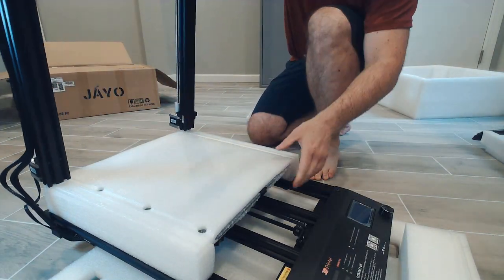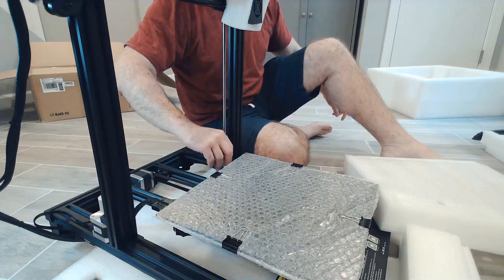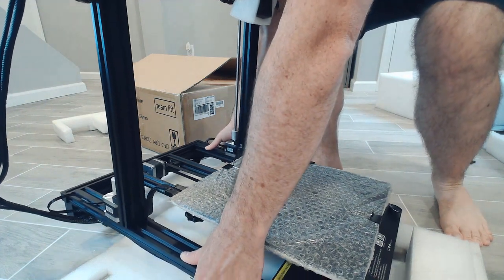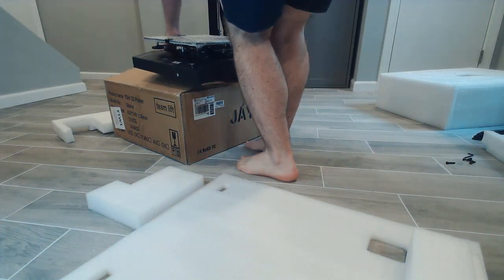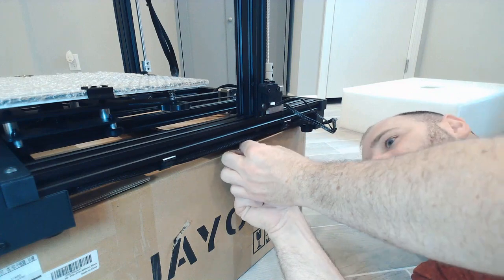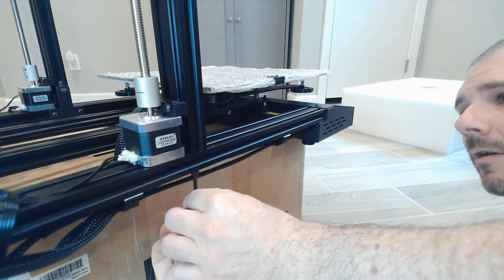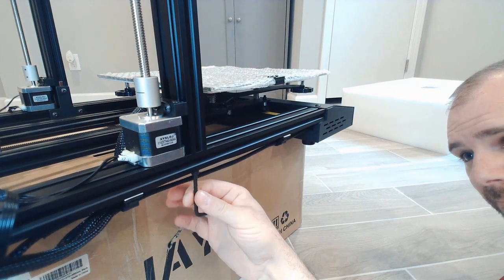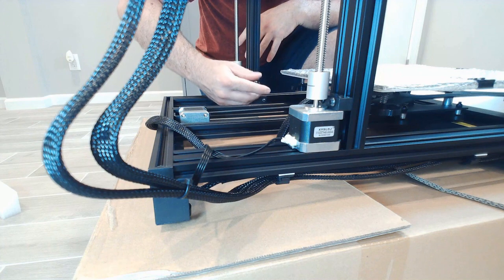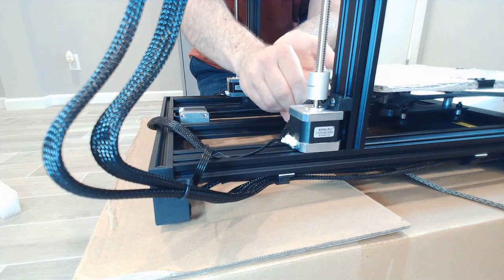We clip the cable ties to release the Z-axis rail from the printer base and then mount that base. There's a plastic T on the base that connects to the Z-axis rails — put the screws in there lightly, don't tighten them yet. We want to tighten the base to the lower portion of the rails first. I put the printer on the box and keep one side hung over so I can access the screws underneath. I have to say I was impressed by the wiring — there's even a sticker under there that tells you not to snag any wires while tightening, and it's all routed very nicely and neatly.